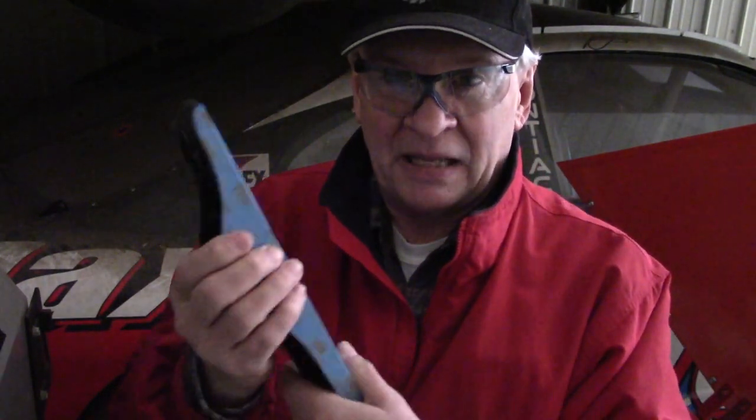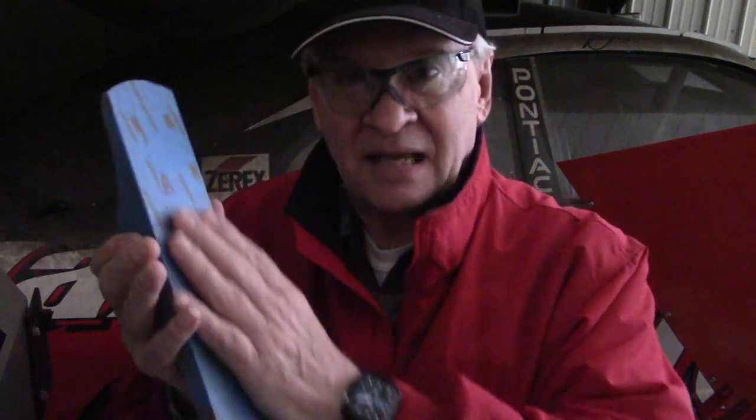He's taken the plane base and taped it to protect these important machine surfaces that I've already prepared, so we're not going to injure those while we remove the remaining japanning on the inner surface of this plane body. So here we have the plane body inside the sandblaster, the nozzle, and it's foot controlled. So we're going to start trying to sandblast and clean this up.